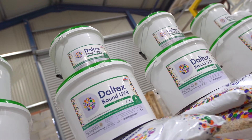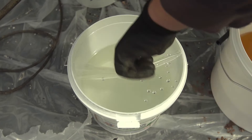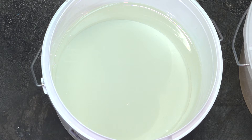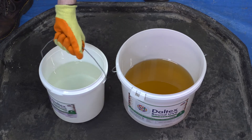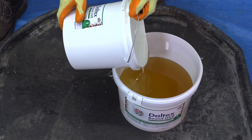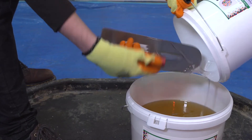Mixing the resin is a very important part of the process. Our two-part kit is designed to make consistent, high quality, high performance mixing as easy as possible. It is critical that both parts are mixed together in exact proportions. To ensure no accidental splashes, mix the resin in the container on a plasterer's board or some other protective surface. Add part B to part A. In order for the resin to cure properly it needs all of the hardener in the mix — less hardener will result in some of the resin failing to cure. If part B looks milky or has crystals within it, it has been exposed to moisture and should not be used.